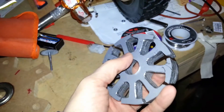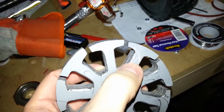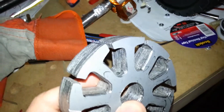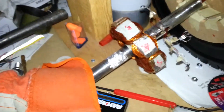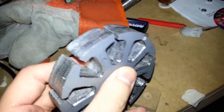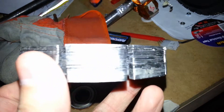I'll tell you the next steps. Before I put the wire on here, what most professional electric motors do is put in an electrically insulative paper basically inside here — it stretches across and they wrap the coils around that. The problem is it's hard to get it to stay as you're wrapping it, and when you're doing it with a machine it's a lot easier. What I did on this one was use some glue right in here. But the problem with the glue is that it is also an insulator to heat, and you want some heat to be able to flow out of the coils into the stator, because you want to get rid of some extra heat in the wire. So I'm not sure exactly what I'm going to do there yet, but you can see this is all made of individual pieces of silicon steel.